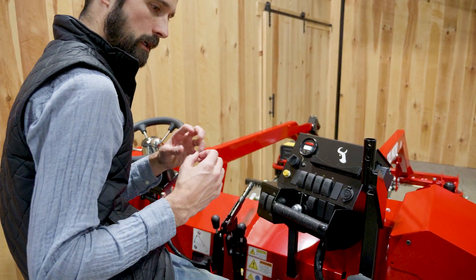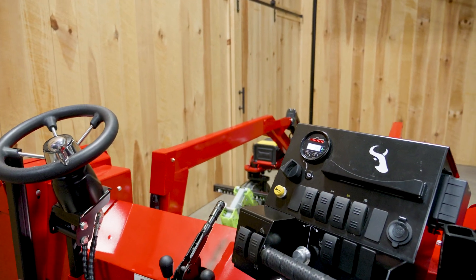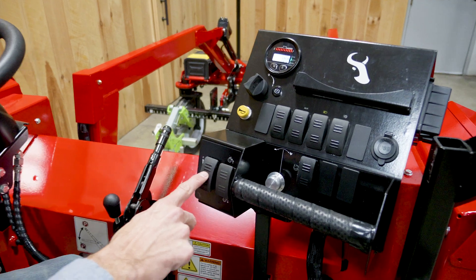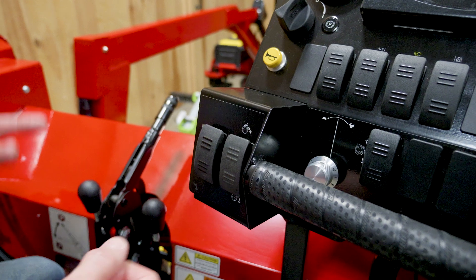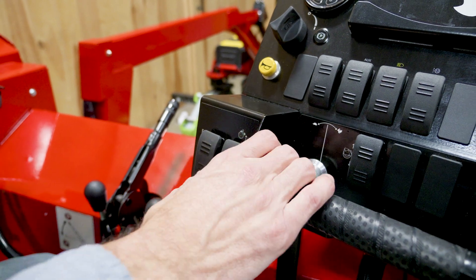So there's the operational driving aspect of it, and then there's also the tool engagement aspect, and then we have a couple accessories. From a driving standpoint, we've released the mechanical brake, and then we have a forward, neutral, reverse switch — acts much like a golf cart where you can go between forward and reverse without having to stop.